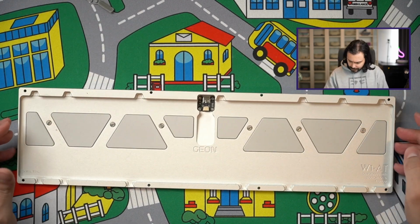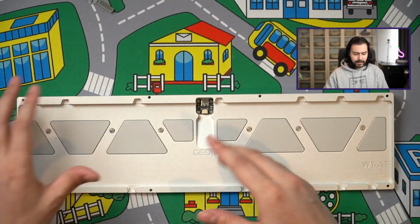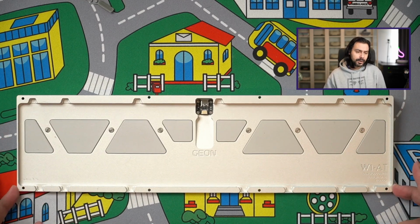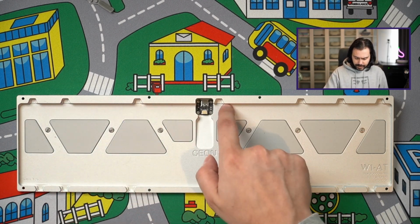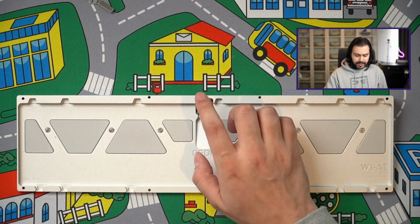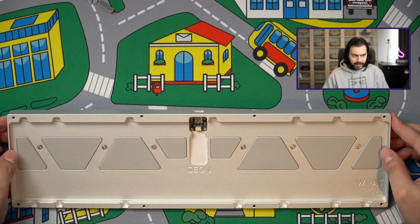So fairly simple. It's a seamless assembly. The top essentially sits over the bottom, so I don't need to see any alignment tabs or any alignment pillars. The case itself is gonna align just fine. We have little locations where the tadpoles essentially rest on the bottom, and we've got ourselves a tiny USB daughter board. It looks like the standard AI03 footprint.